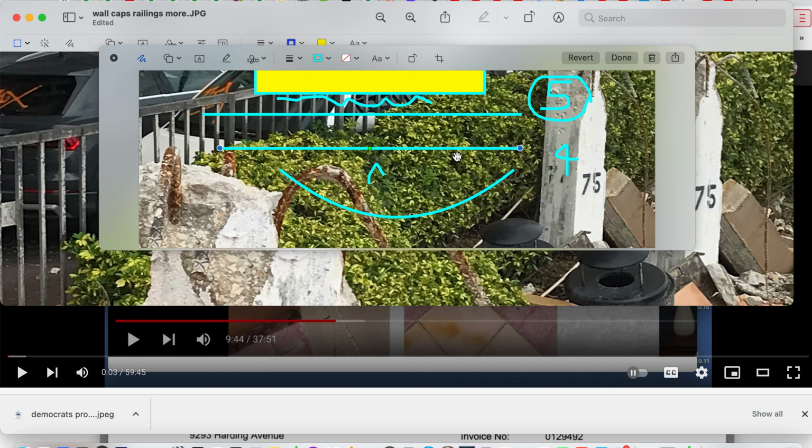Upon deflection, the first thing you get is a breakdown upon your steel at the end. That's because it's now spalling off, ejecting off. And then you get the transfer, since that's no longer capable of holding the deflection. Then you get this transfer into the concrete now holding. The first point of its holding is wherever you see the bottom crack, the initiating crack. And then the next point is right above it, because now the profile of the concrete is reduced. And the load is still being applied. And then now it's reduced again.